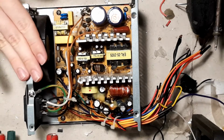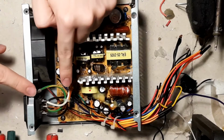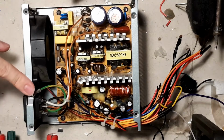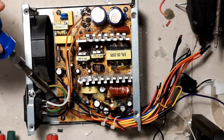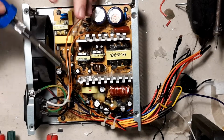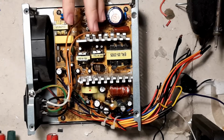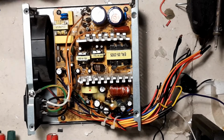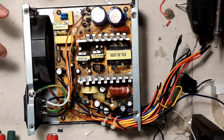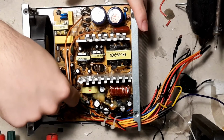This is called under voltage protection, and it's controlled by this IC here. You can kinda see it. It's like a 14 pin IC. If you Google the part number, this is a 205. If you get lucky, you can get a data sheet, but some are in-house ICs and you can't find a data sheet. I will leave a post in the description that will give you a forum post with most pin-to-pin matched ICs. It'll help you lots.